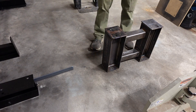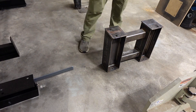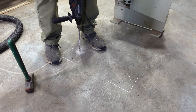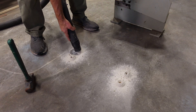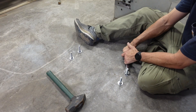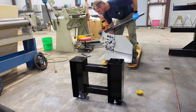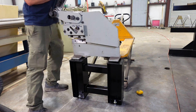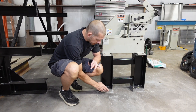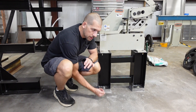We are laying this out on the floor just before we drill our holes. We're using wedge anchors here. I'm going to go ahead and paint it now so it has time to dry before we put it on the studs. I'm drilling holes now to insert the studs. I got 7-inch studs, but I wasn't sure if those were long enough. 7 inches should be long enough, but we've got a heck of a gap here to fill. Once we bottom out those studs, we still have to have room for the nuts. So we put the wedge anchors in, bottom it out, and there's a nut on the concrete which tightens it up.